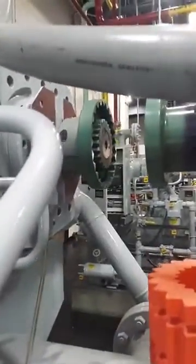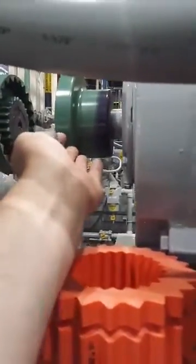So what we have right now is movement. I just turned the compressor back off, and what we are checking is this direction of rotation, trying to match that. She's turning the right way — we don't have to change the phase. Nevertheless, we wouldn't want to throw the female rotor out of the housing. If you've got an older machine that doesn't have the arrow cast in the housing, there is a way it turns. Come to GCAP Operator 1 and we'll show you how to figure that out.